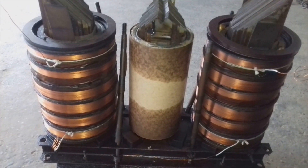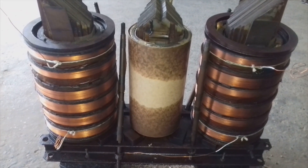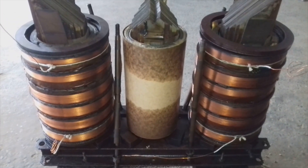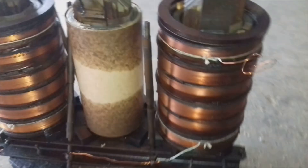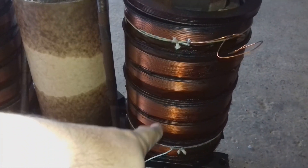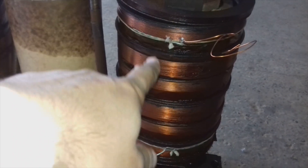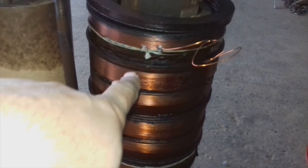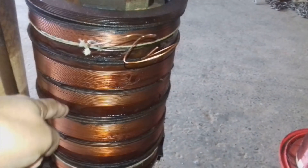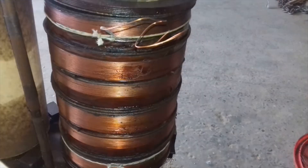Many people have questioned why these windings are made in disk shape. This transformer has been wound in six disks — you can see six winding disks provided here. For LT you can also provide a single disk, and that will work, but the disk shape has its own benefit. The disk shape is used purposely because this limb has 11 kilovolts applied to it.